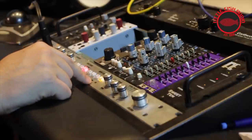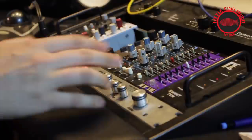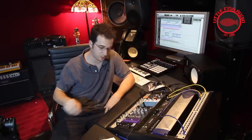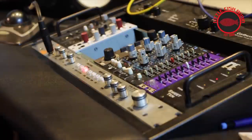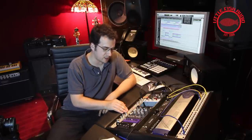All right, so the CD is like the DAW and that is also a digital input, right? The idea behind this was to have maybe an iPod dock or something that you plug into the back of the D-Box to get a digital input, and then the D-Box will be the one doing the converting, so we're not using the actual iPod converter. But really, the CD is just a label. You can put just digital 2 in here and any digital source you'd like through there that is AES. If you're running SPDIF, there are SPDIF to AES cables and impedance converters if needed. So once again, a lot of uses, very flexible.